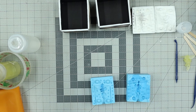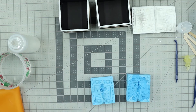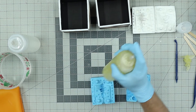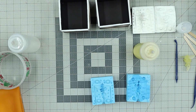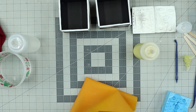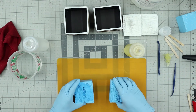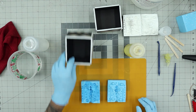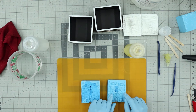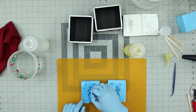I've got my Part B of Cast 50 in warm water so it's heating up. You don't want water anywhere near your resin, so dry that bottle off and get it nice and dry. What this does is it makes the resin nice and liquidy so it releases all the air bubbles. I'm going to lay out a silicone mat, put the mold pieces to the side — not dropping them into the box yet. I'll pour in a small amount first and make sure I go through all the little details to get out any air bubbles that might get caught.